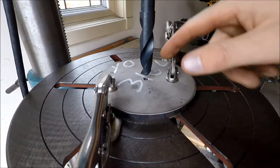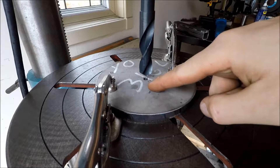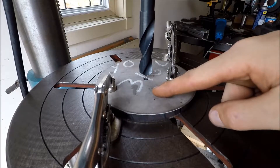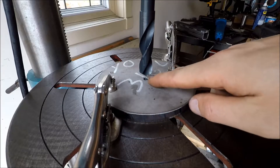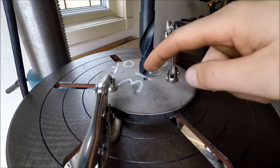So what I need to do here — this is a three-quarter inch drill bit. I have to put a counterbore in here to hide that bolt so that this is nice and flat. But I'm not gonna go and buy an expensive counterboring tool, so I'm gonna use this to make a pilot hole for the three-quarter inch, then I'm gonna cut this flat and use it as a flat-bottom drill bit.